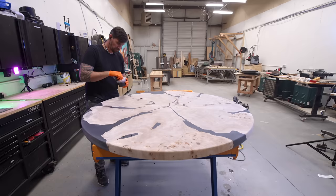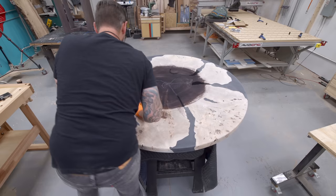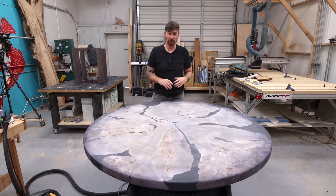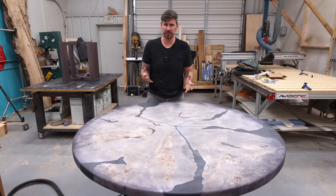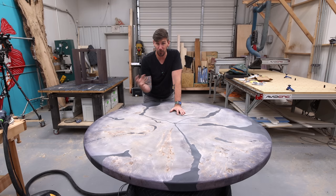I'm staining the bottom first, then I can switch to restaining the top. Being my second time around, I learned a few things — I mixed more stain into the water so it was a deeper black, which lets me stain the top in one go instead of multiple layers. I started from the middle and worked my way out and had way fewer lap marks, only needing one coat. I think it looks pretty good, and once I get some epoxy on this, it's really going to pop.